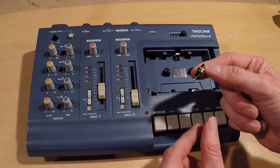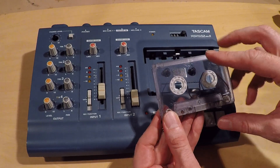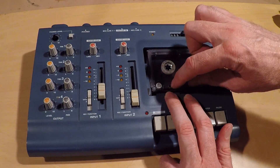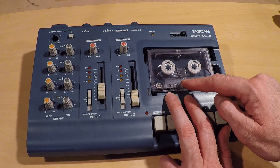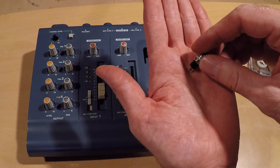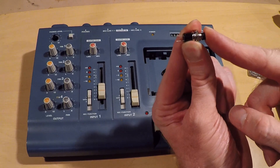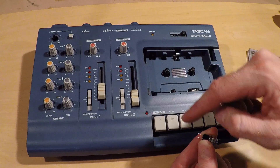The reason why you want to do this is if you're trying to record tape loops and you want an endless tape loop, but the space between the record and the erase head — that little space will give you a skip or a pop in your loop. So we're going to use a normally closed push button switch, meaning these two points are always connected until you press the button and it breaks that connection. So I'm going to wire that in line of the erase head.